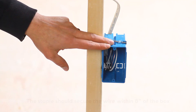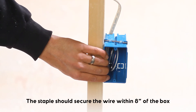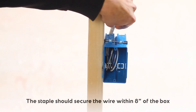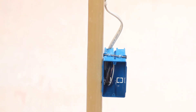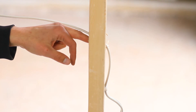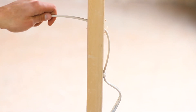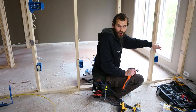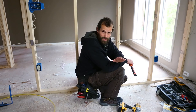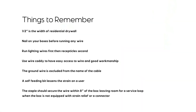In this situation, the staple should be located within eight inches of this type of single-gang nail-on box. I want to allow just a little bit of service loop on that box. My hole is located above the staple strategically so that I'm not kinking the Romex. When I pull it through that hole, I want to allow it a smooth passage over that edge — I never want to damage the cable when installing it. I want to leave the outer jacket unscathed and intact.